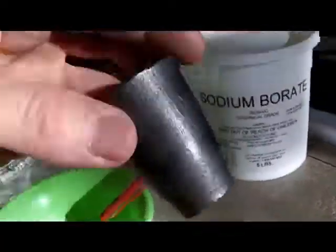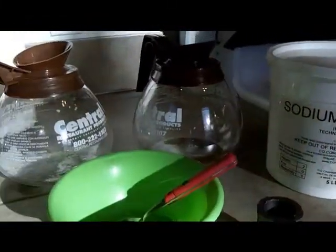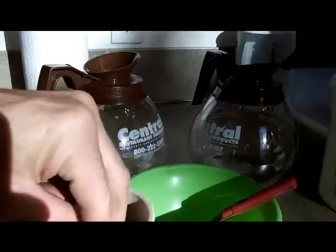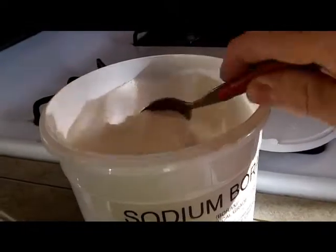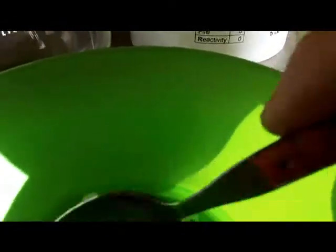I'm going to put the gold in. I have my graphite crucible — it's tiny, but there's very little gold so I won't need much space. Although I am worried about it overflowing, so I will contain it within this larger crucible. I'm worried because the borax and stuff tends to foam up. I'm going to start with my quartz — I won't even use all that. Then I'll get a scoop of the borax.